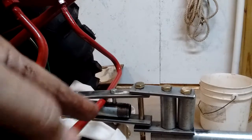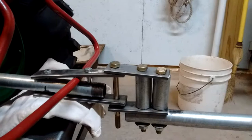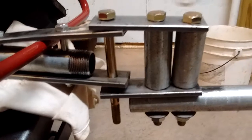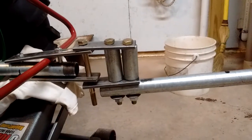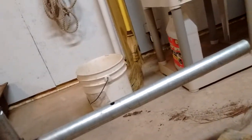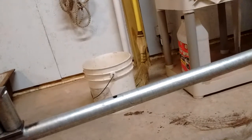It will be locked in here because of the tension on the inner clevis against the saddle bar, so it's not going to go left or right. The hitch won't move; only the clevis point will be moving left or right. I weigh about 235 pounds, so I reinforced that outer clevis with the same pipe I used for this extension for the tongue, which will be slid into the sulky tongue — so that ought to be good and reinforced.